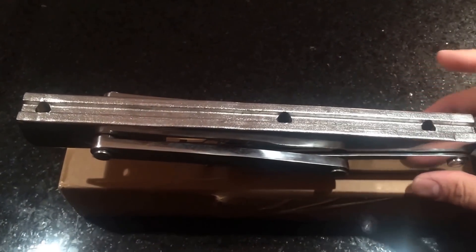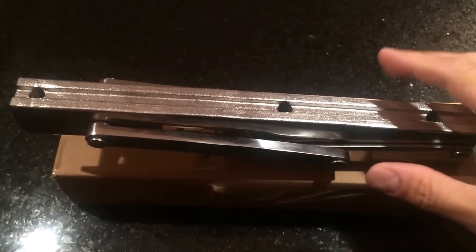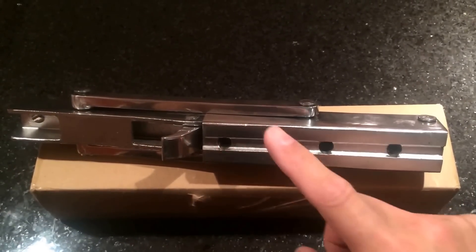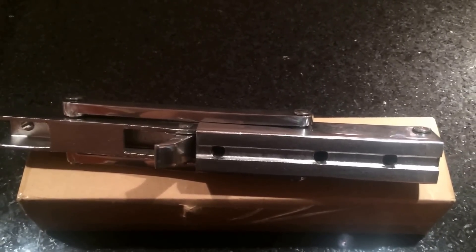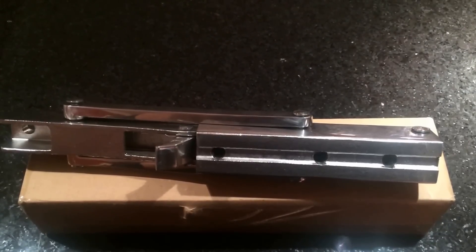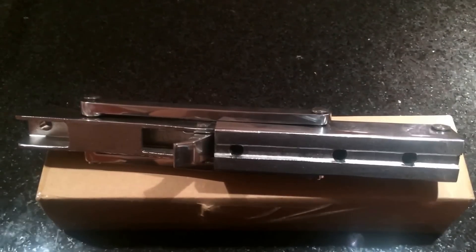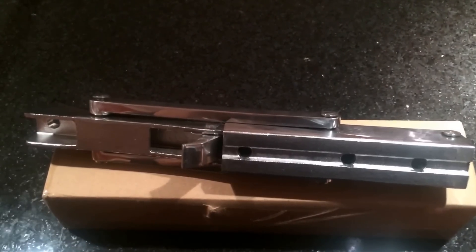I can through-bolt the bench itself, but when it comes to attaching this short arm to the stern, I'm going to use some lag screws. I'm going to take the channel that runs along here, fill that with some 3M 5200, and come through with probably three-eighths or half-inch lag screws. I think those lag screws combined with the 5200 will create a very good mechanical bond. This is going to be going into a one-inch thick oak plate that will be epoxied to the three-quarter inch ply of the transom, which should create a very solid mechanical connection that should stay put.